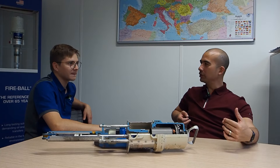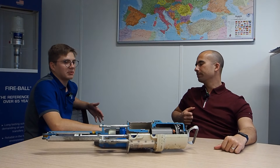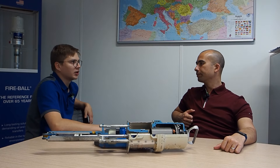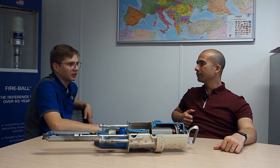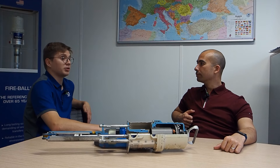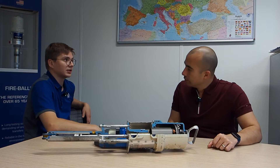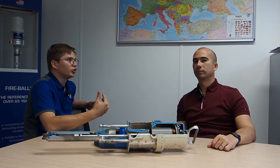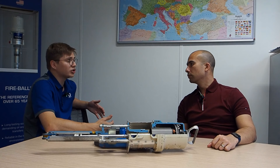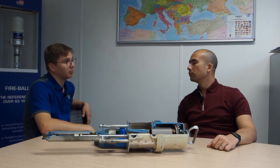With additional back pressure from all the lines, you're expecting much slower - maybe 1.5 kilos per minute. When you imagine 180 kilos at 1.5 kilos per minute, it will take a couple of hours to refill. It's a true story - if you speak to someone about how much time it takes to refill the auto-lube on a big shovel, they'll most likely tell you it's a pain. Those typical 50-to-1 pumps on lube trucks do a great job for manual lubrication, but for transferring grease, it's not the ideal pump.